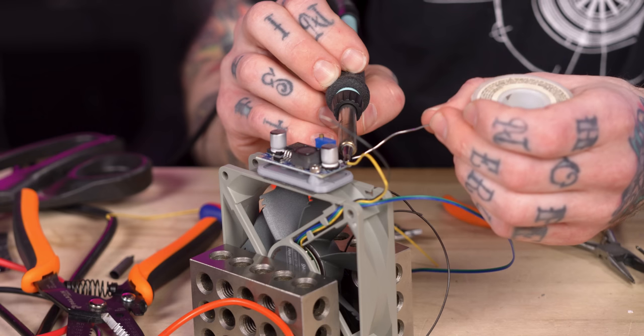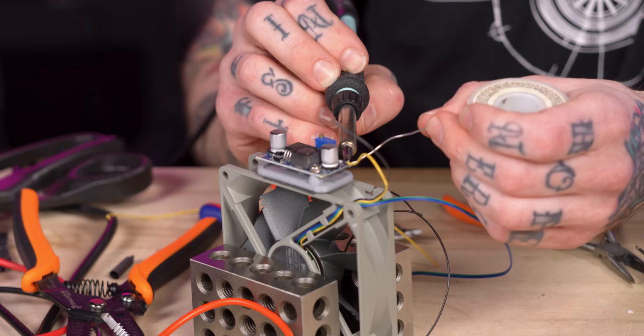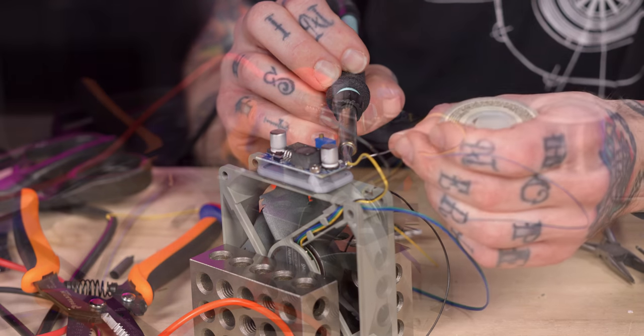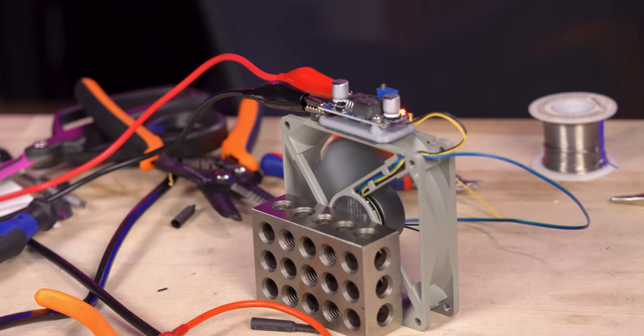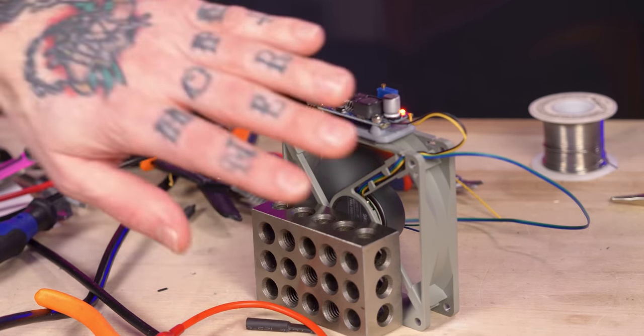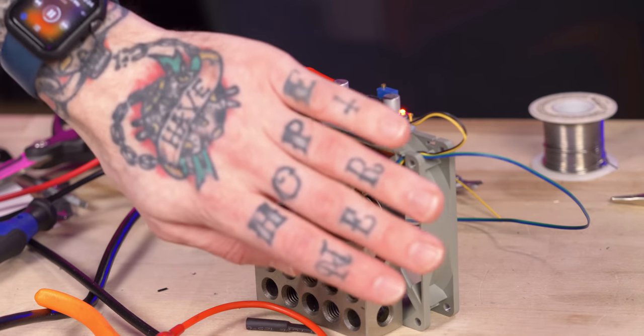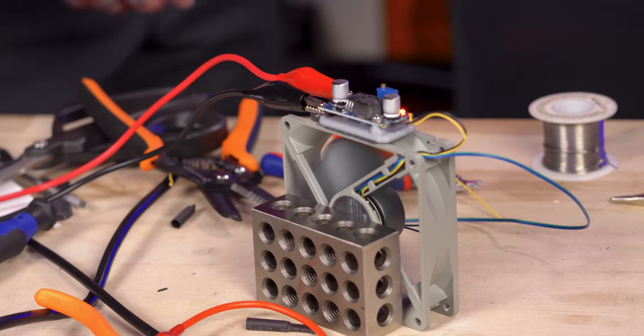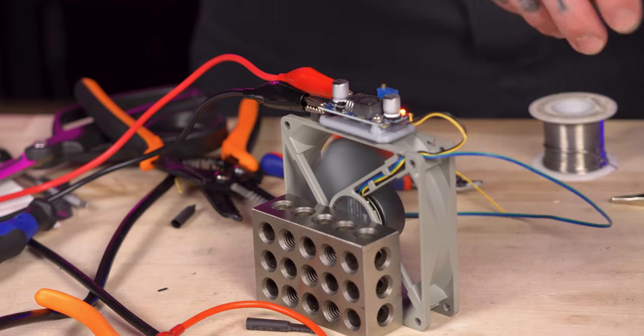After that, it's as simple as wiring up the fan's power wires to the buck converter. Wiring diagrams for Noctua fans are easy to find, so this wasn't hard. A quick test run to make sure the circuit's working properly — and of course it is. I did end up dialing this up to about 13.5 volts, just to push the fan a little harder for a little more airflow, and it's still much quieter — you'll see in a minute.